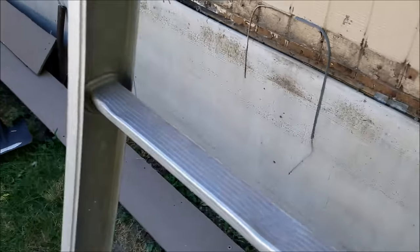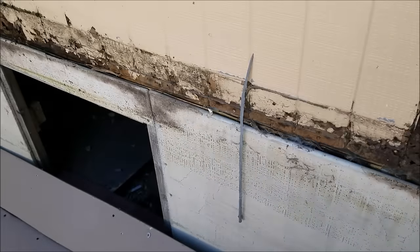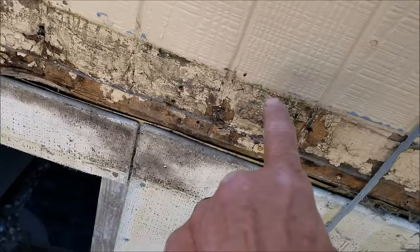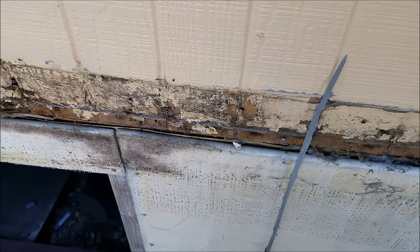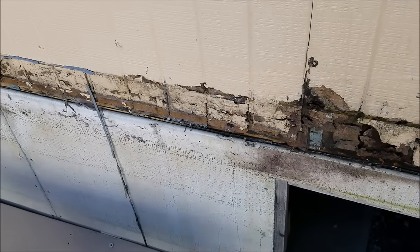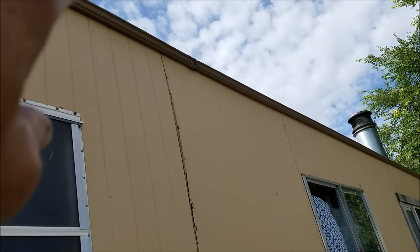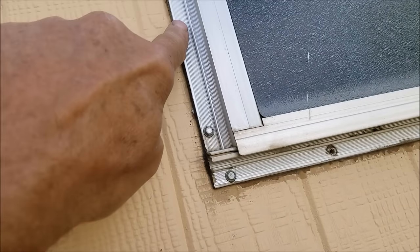This trailer house is a permanent resident in this trailer court. We're going to cut our new siding right there and stick it down on top with some drip edge to keep this from happening in the future. First thing we got to do is pop all these loose up top — they've got quarter-inch hex drive screws.